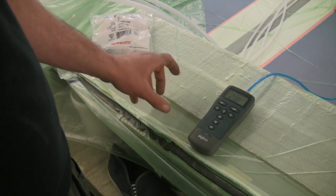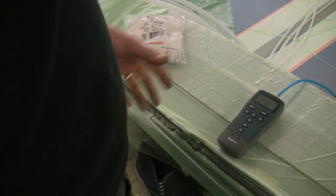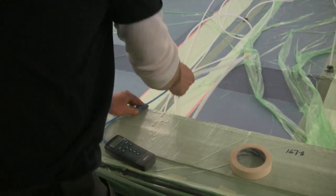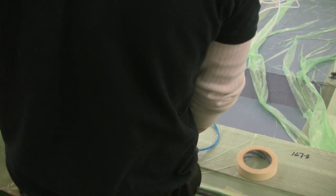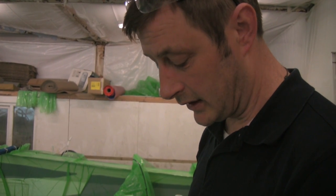We have a bag pressure here, just taking it from the pipework. We'll just be able to check the other pressure. I'm just going to check this one and we'll do a drop test and check that again. This is the pressure of the active vacuum — we're doing a drop test. You can see the bag is sufficient to continue.